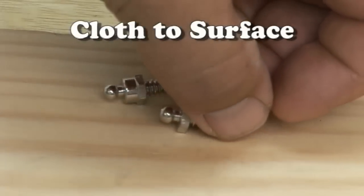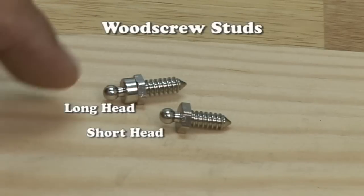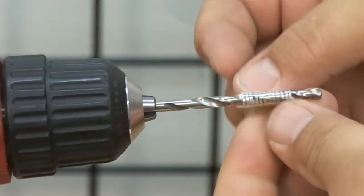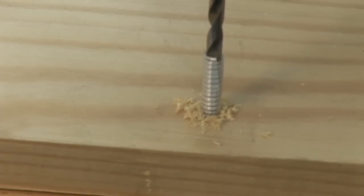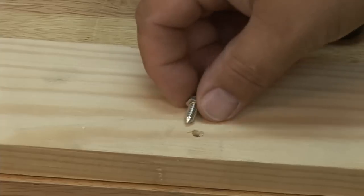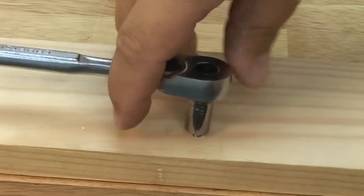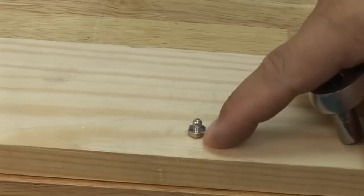For cloth-to-surface applications you may choose the wood screw stud for wood or fiberglass. There are two choices: the long head or the short head. These screws require that you pre-drill a hole — we use an 11/64 drill bit to do this. We'll measure the length of the screw and then put some tape on the drill bit to determine how deep we need to drill. You do have to drill it the length of that screw, otherwise it will not work. Start that stud right in that hole — you can do this in fiberglass and as shown here in wood. Then we use an 8mm socket to screw it in place. That's the short head.